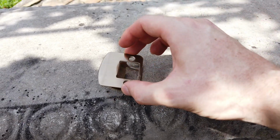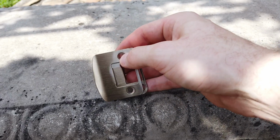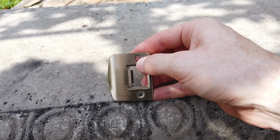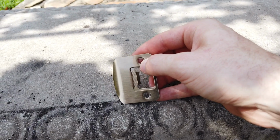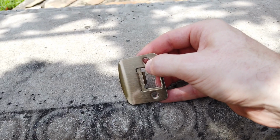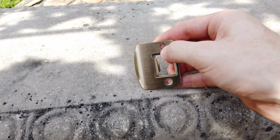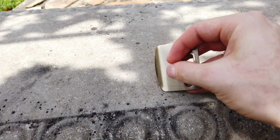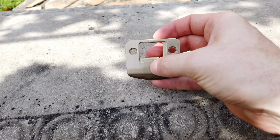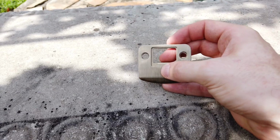And so, you know, you put the striker plate on top of, I guess we'll call this back plate the keeper plate. And that little piece of metal I pointed out earlier lines up with these lines, so you can adjust it again with those oval holes on the back. So when you tighten everything down, you screw everything in, this piece of metal bites into these score lines. It's very difficult to capture this all on camera.